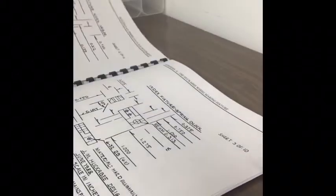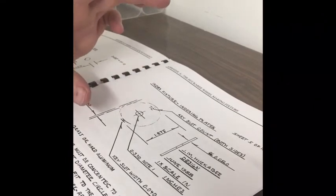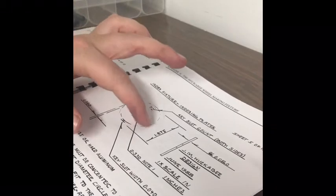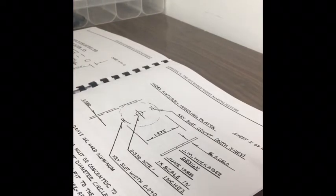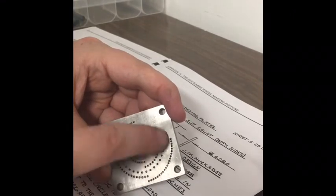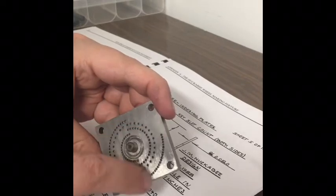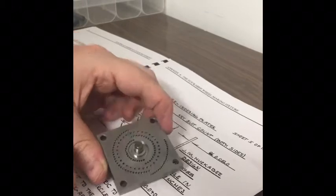Flipping through the book, there are kind of dividing plates like this. I'm going to make different wheel blanks out of sixteenth-inch thick brass - maybe a little thicker, about two millimeters. I'm going to cut a certain number of slots in these, so I'll have them for 32, 36, 40, and different things. I made this little fixture last week, and on each one of these circles I have positions indexed for all of those different wheel spacings and tooth counts.